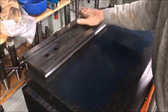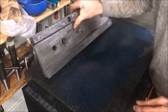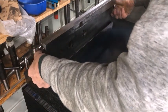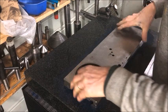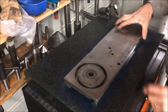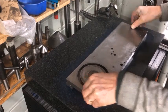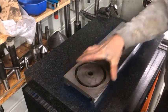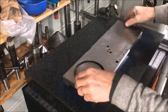Do the same on the part, then invert the part onto the thin coat of marking compound — thin so you can see through. Set it directly down, then hinge the part and feel for where it hinges. This has been scraped about six cycles in, so it starts to suck down.